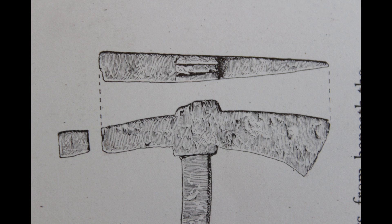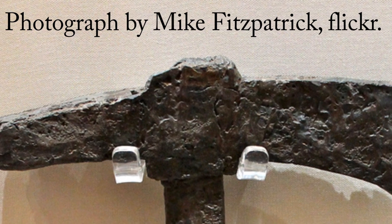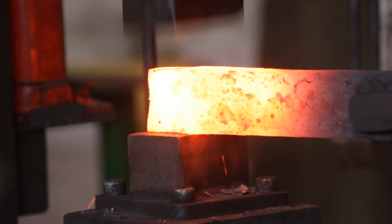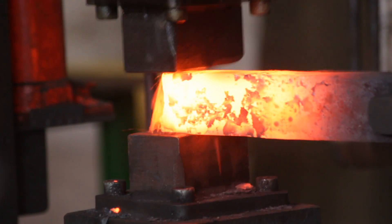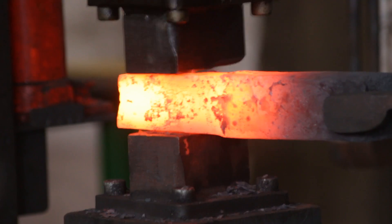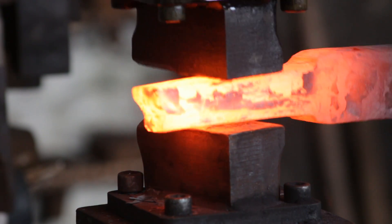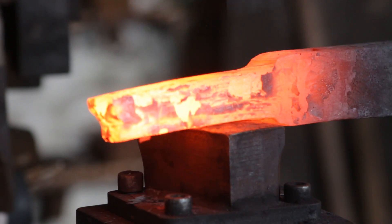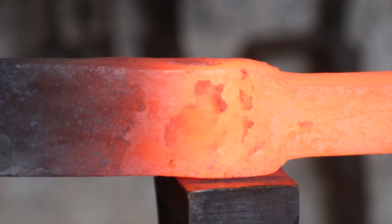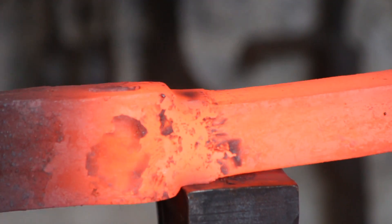The next part is to create the cheeks around the eye. Looking at a photograph of the original, you can see that the eye actually goes all the way around the punched hole, which isn't actually shown in the drawing. So I am purely going to draw out the ends on each side of the eye and it should give me the effect that I want. Under the power hammer, working on the hammer end, this wants to be about 30 millimetres square. I am having to dress the squareness of the part by holding it slightly on the diamond to forge it back straight. Once forged to roughly the section I want, I will go back to those centre dots and get a nice crisp clean transition between the two, as per the drawing and the photographs.